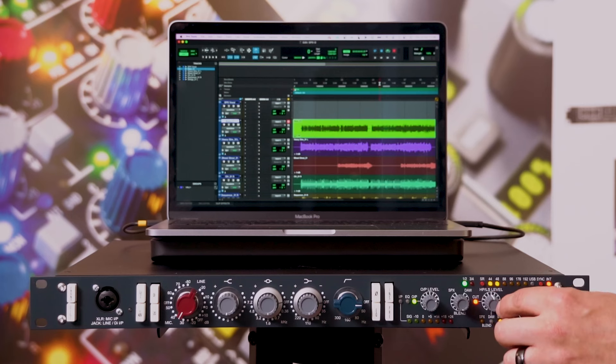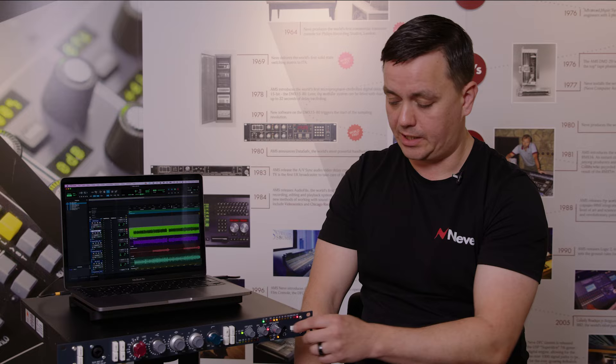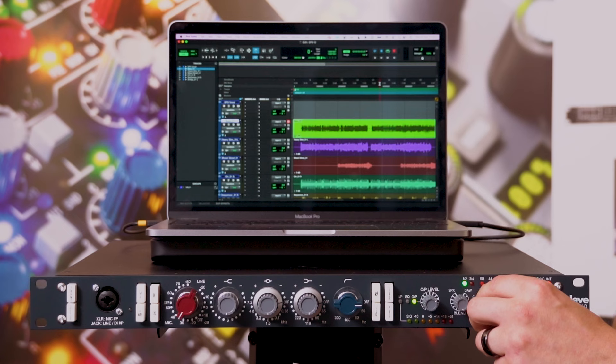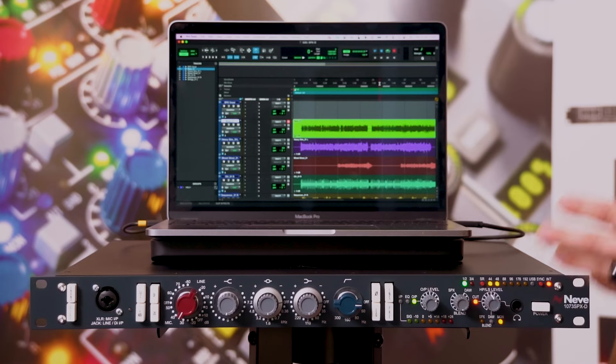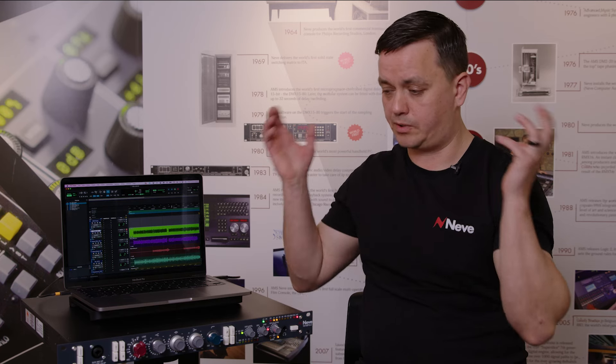The main output level controls our stereo pair of XLRs at the back, which can connect directly to active loudspeakers or a speaker amplifier. There's a full range level control with a center detent — just like the ATM — which is 10 dB below the maximum output level of 20 dBu, going all the way down to minus infinity. You can calibrate your speakers to an ideal listening level at that detent, and quickly cut the speakers by pushing the pot.